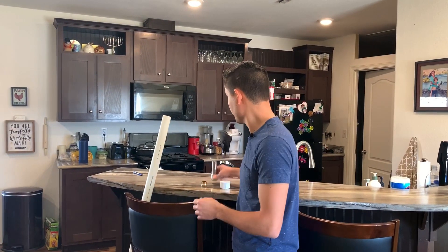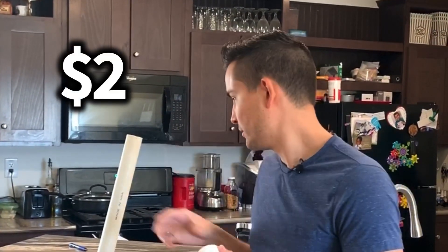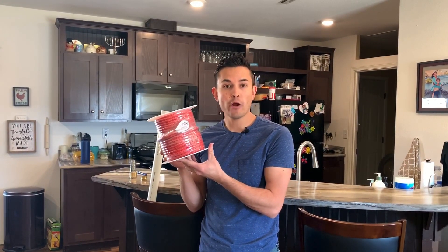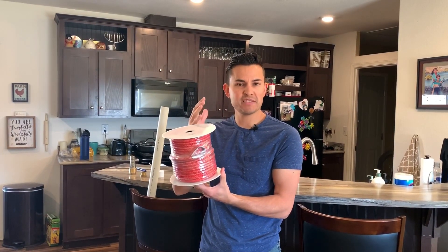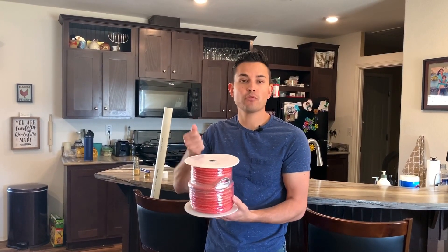So items that we're going to need to do this. We have a foot valve, got this on Amazon for $13.99. This is going to let the water go into the pipe but then not fall out as you're pulling it back up out of the well. This hex bushing is a one and three quarter inch hex bushing, eight dollars. One and a half inch PVC cap and then a one and a half inch PVC pipe about five feet long is what we're going to start out with. We also bought 150 feet of marine rope — the cheapest durable rope I could find. The water level in our well is between 70 and 90 feet so I needed about 150 feet of rope to drop the pipe down and then pull it back up.